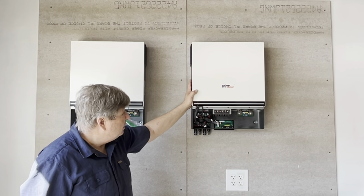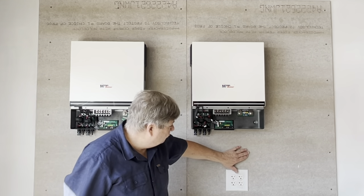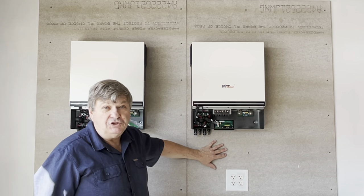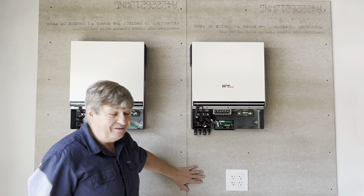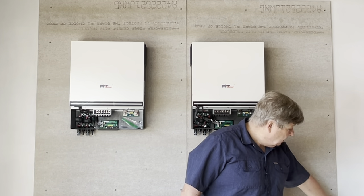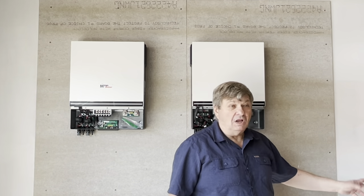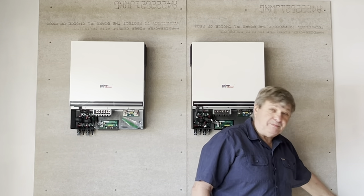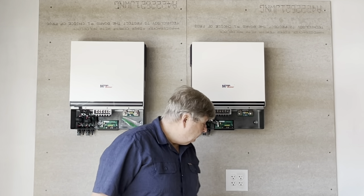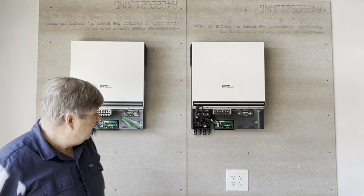You can mount these onto some hardy board or backer board. I found some nice backer board screws — you can find those at Home Depot, but look in the area where they have them on the shelf, not where the fasteners are. We have the emergency generator input — a Predator 9500 inverter generator with a 50 amp cord. We changed the connection at the generator end to 30 amp, so we can run the generator a good distance away to supplement the solar system. It's nice to always have a good generator as backup. We have the interlock panels on the opposite side on the outside, and we've got to run interlocks. That's pretty much where we are right now.